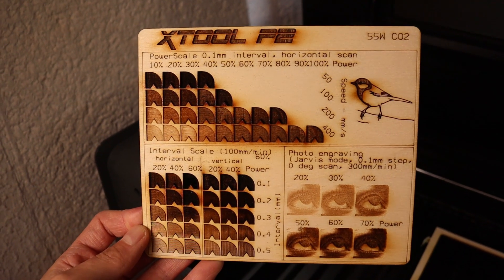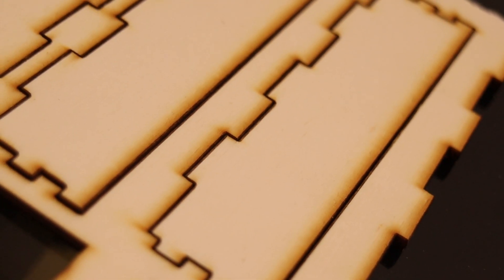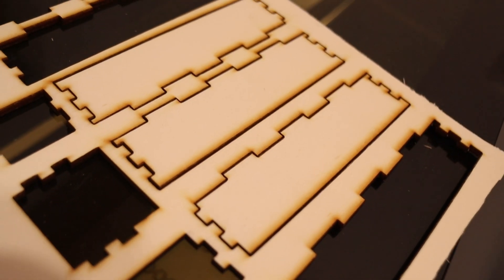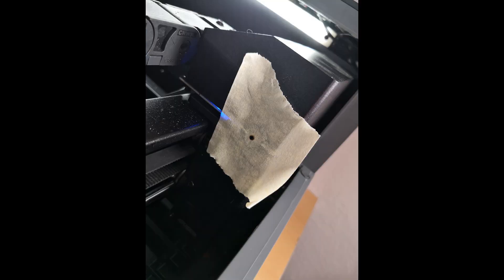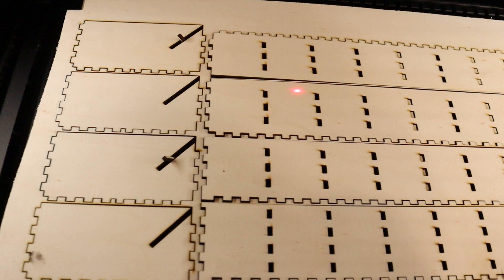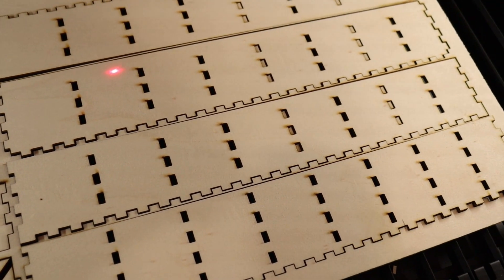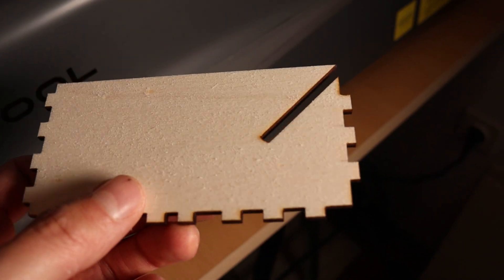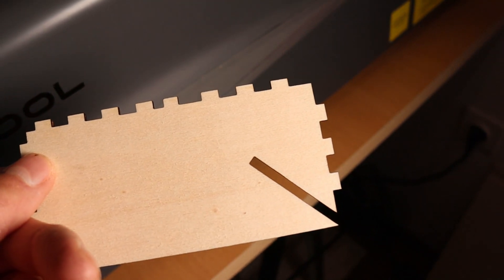In my recent review video of this machine, as well as in the beginning of making this project, I noticed a lot of smoke stains on the surface. I checked the laser beam alignment and noticed that it was not properly aligned. I followed the alignment instruction video and aligned the laser beam back in the middle, and immediately noticed that the cutting quality improved significantly. The reduction of smoke stains is amazing. You should definitely check the beam alignment after installing the machine in your workshop.